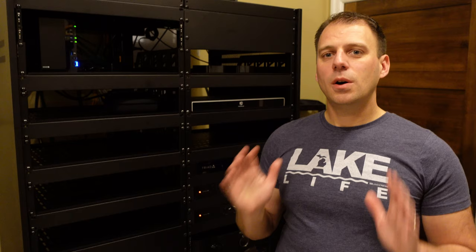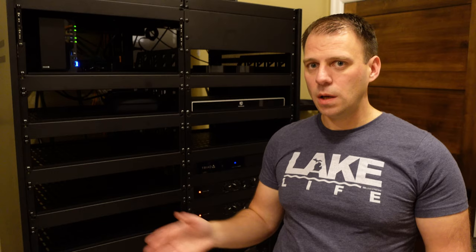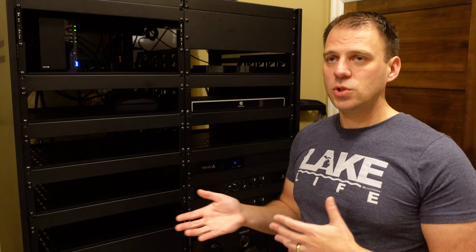It's a hundred times better to just ensure that your stuff is on when you need it to be on and off when you need it to be off — and you're not wasting power having stuff on needlessly. So use the triggers. Better receivers and pretty much any pair of separates will have multiple 12-volt triggers that are very configurable in the menus. Most triggerable devices have pass-throughs so you can chain trigger sequences if you have multiple amps. Having changed everything from auto-sensing to triggering, here's how it works.